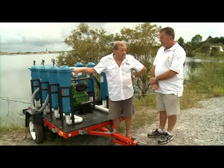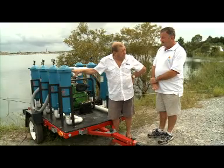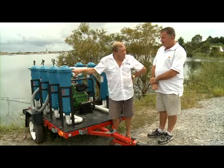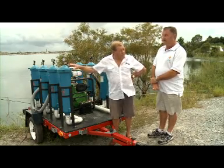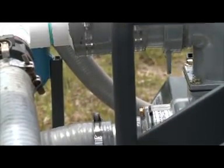Well, it's always been a problem to get very fine gold dust out of water, and this machine here will take up to 1 micron of gold dust out of any given water area, which is very, very unique. Now, to achieve that, it's done by the use of carbon, which is pre-activated into these cylinders. At this stage we're using 8 cylinders through a 4-inch intake diesel motor through a twin-engined manifold.